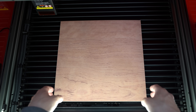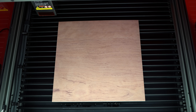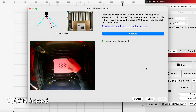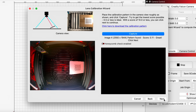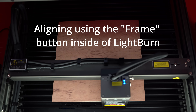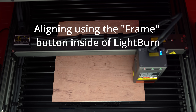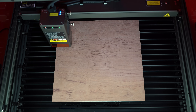There's only one last thing we need to do, and that's to align the workpiece with the DXF in Lightburn. Creality has made this process super easy thanks to the camera mounted at the top of the laser. This does take a little bit of work to get calibrated, but once it's done you'll be able to accurately align your cuts in just seconds. As long as everything is squarely inside our workpiece on the camera, we know it's good to go. For larger parts like these, it's pretty easy to just align by eye, but if you were trying to engrave intricate details on smaller objects like coasters or keychains, the camera could be an absolute game changer. That's enough talking — let's get making.